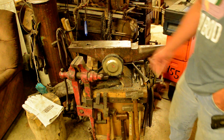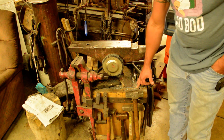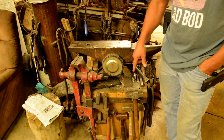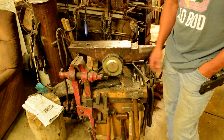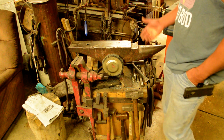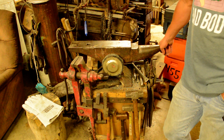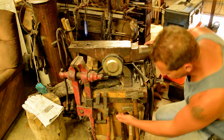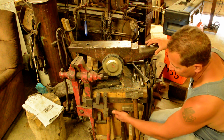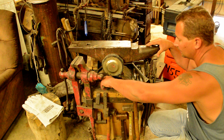So what I did was I took what looks like about 3/4 inch plywood and 2x4s, and I built an open top box with a floor on it, of course, so that I didn't stick the new concrete to the concrete floor of the shop. Poured the thing full of concrete. I want to say I did it in 2 sections, so I might have filled it up to here or so on the first pour, and then let that set up for a couple of days, and then poured the top portion,